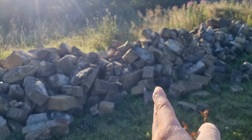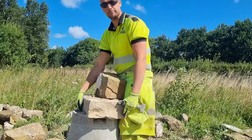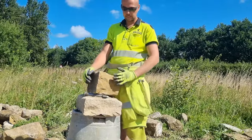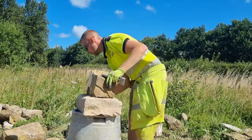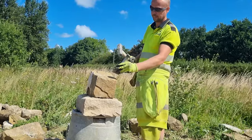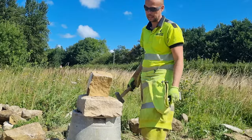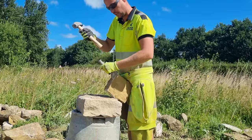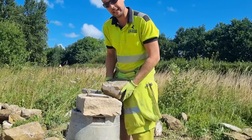Day four, day five — let's get stuck in. One of my top tips when you're backing off pretty plain stone and it's quite tight: that's your face, that's your back. I'm going to back this off but I'm going to go down the tooth — it goes across the bed and it should break off nice and flat. It's just a little trick. It looks to have gone under a little bit there, but it's still okay because the bed size in this video is between four to five inches. Sometimes it helps to go down the tooth.